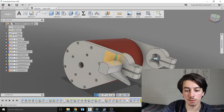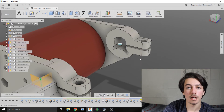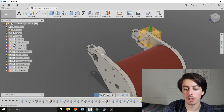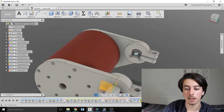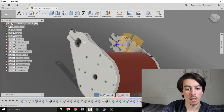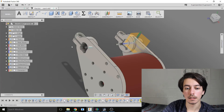This is what the motor mount looks like — here's the profile of the truck roughly. With PLA these would always break right here when I went over one specific bump. Nylon is a lot stronger and more resilient so these connectors should last a lot longer. I may make it a little bit thicker in that area just to ensure that. The motor will be sticking out of this hole in the center, and the belt will attach right here and connect to the wheel.